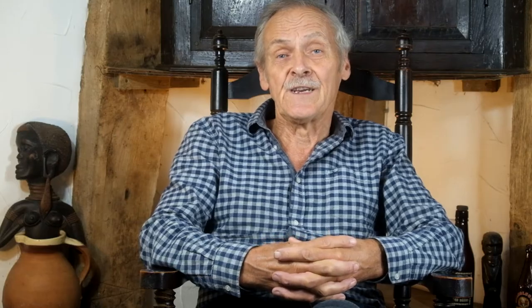And finally, pay attention to the individual welds. Inspect them. If there's any sign of distress in any of the welds, they need to be cut out and re-welded. And the surface needs to be dressed off with a grinding wheel to get a smooth profile.